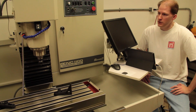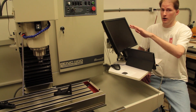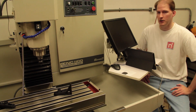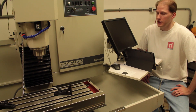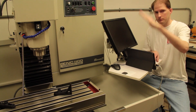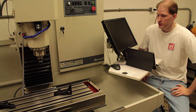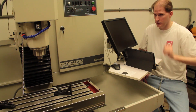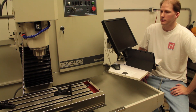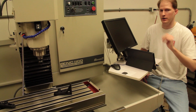On the lift bar, if you have another device like a load balancer for an engine, you might think you could use that to balance the load, since the load is not centered on the mount points on the machine. First, you'd need to make certain your load balancer is rated for the weight — if it's meant for two or three hundred pound engines, it's probably not going to do well with a 1,300-pound mill. Further, the load balancer is going to take up vertical space. In my case with my engine lift, it was too much — the engine balancer would have consumed so much vertical space that I wouldn't have gotten the machine up high enough to set on its stand. The lift kit is effectively a big piece of metal with a couple of hooks on it, so it consumes the minimum vertical distance you can get away with to rig the machine up for lifting.